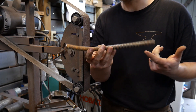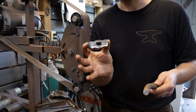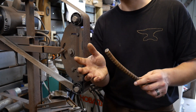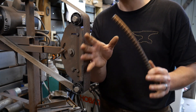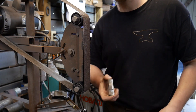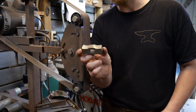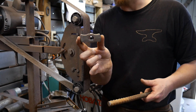You can use some junk steels at a reduced cost versus having to spend money buying a full 20-foot length or drops of good quality high carbon steel. But if you're doing this as a profession — making hammers, punches, or tooling for other people — don't use mystery steel. Use quality steel you've bought yourself that you can verify from the factory is exactly what it's supposed to be, so you can follow proper heat treating and hardening practices for that material.